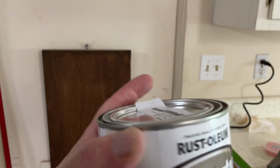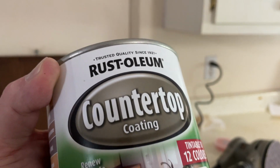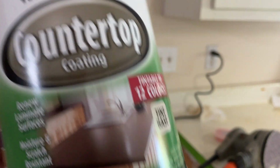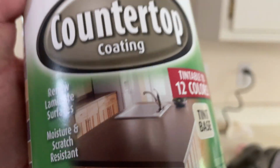So when I have a bonding primer to smooth it all out, and then 2 coats of this, I think it's going to, number one, look nice and smooth, like a resin material. And number 2, it's going to be hard. I'm not going to be setting things on it. It's the sides of a cabinet and drawer fronts and doors and things, so it'll be easy to clean up. And theoretically, it'll be nice and hard and should last a good long time.